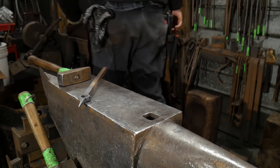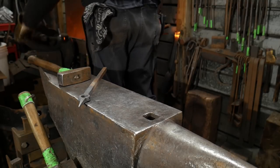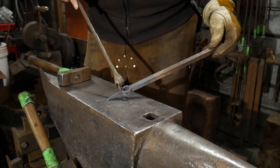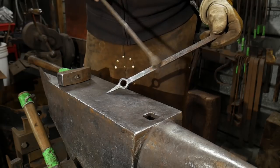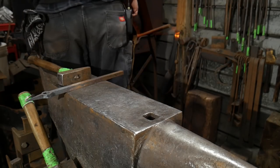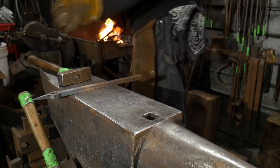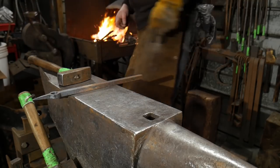I'm trying to make this a nice quick tutorial for you all. It's a pretty simple weld — and a fun one actually. Because you can add mass and forge this out. To forge this exact thing out might be a pain, but to use a slot punch, drift, and then plug weld it back — and get this look here — can be a very handy thing to do. It can also become a decorative finial if you do more of a rivet on both sides and then a top like that. Could be a very interesting finial on the end of something — maybe an andiron. Sky's the limit, use your imagination.